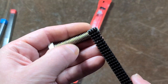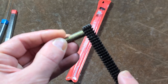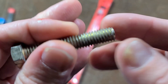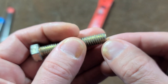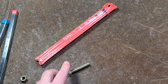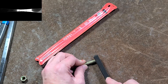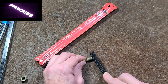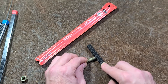You want to be careful to hold it at a slight angle, and then you just use the thread file to go along the threads and try to fix them up. That's exactly what this is doing — you're not cutting the threads. All you're doing is taking the little dings and burrs and trying to cut them off so that the nut will still thread on. It's kind of difficult to do by hand; it's much easier if the bolt is held in a vise. You just take the corner of it, go along as you roll the bolt, and basically hope and pray that it will remove the dings.